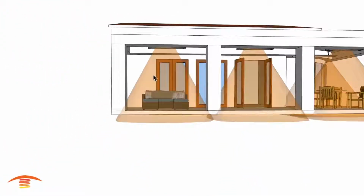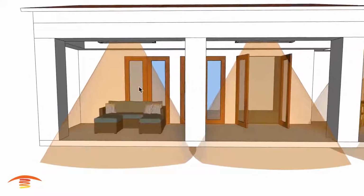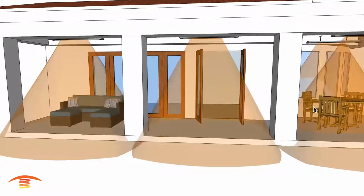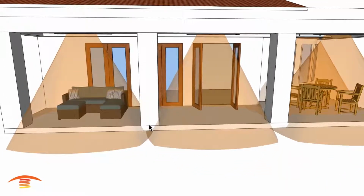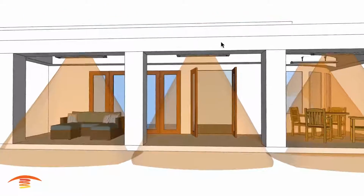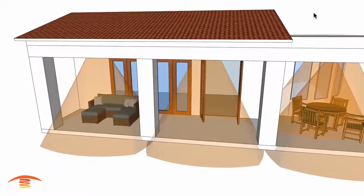And then these heaters here are centered within this opening, the span opening here. So again, the 12.2, so that 6.1 center point, 12.5, so 6 through 4.5, 3.5. What is that? 2.5. Sorry. And that measurement I got is off the center of the post, so you'd want to measure this out and make sure that you're on center here. Okay. All right, I think that's about it.